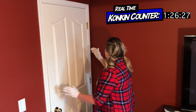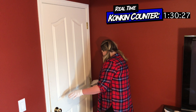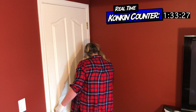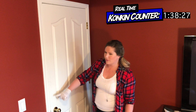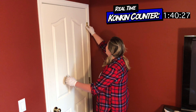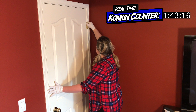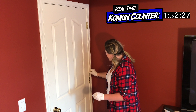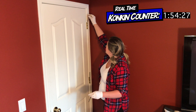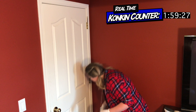Close the door. It's closed, but the hinges are definitely not yet lined up properly. Sometimes it just takes a little adjusting. As you can see, I've gotten a little grease on the door already. So manually kind of adjust that a bit. Then just grab your pins — I like to put all three in at the same time. They won't go down right away, but this way you'll know when it's lined up because the pin will start going all the way down.